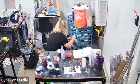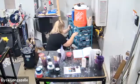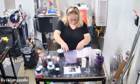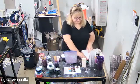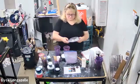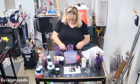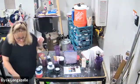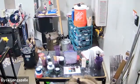A question for Jim. What is the difference between the mold diameter and the average pen diameter? Are you taking it down 10 thousandths or more? Oh, quite a bit more depending on the pen. The mold produces a 3/4 round blank. For my big Avancios, they're about 18 mil on the cap, so that doesn't come down too far, maybe 70 thousandths. For my average pen, it comes down 170 thousandths on the body, sometimes more. But the more layers you remove, the better the swirls.